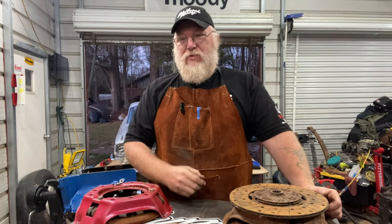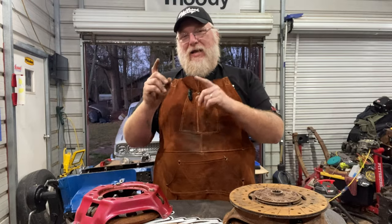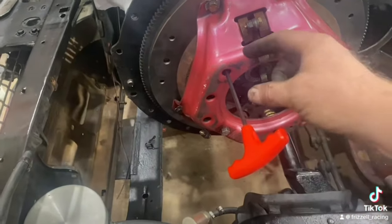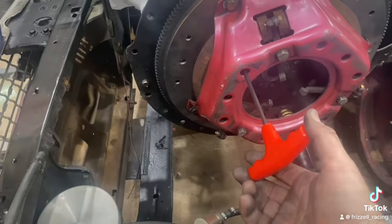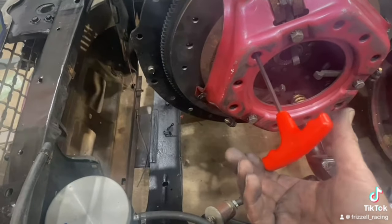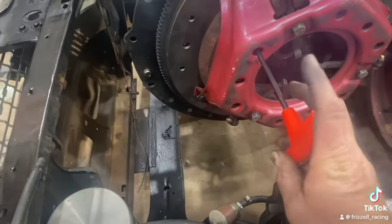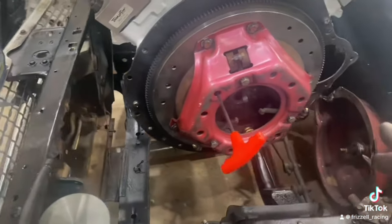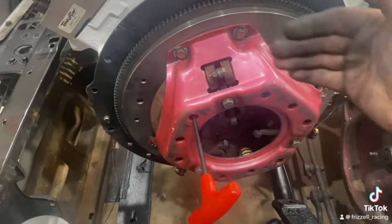I'll insert that video clip from way back - it's a little rough and grainy, but it will show you exactly how I adjust that. It sounds counterintuitive, but you turn this righty like you tighten it and it loosens it. You take all the pressure off, then turn it until you feel it bite right there. You count your turns and set it up for whatever your setup is. You can feel those things flopping loose and then it bites. Then you go through and set them all the same, and mark them so they're all set the same. In a perfect world, that makes the pressure even all the way around.